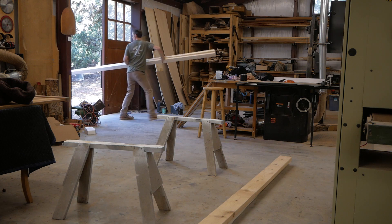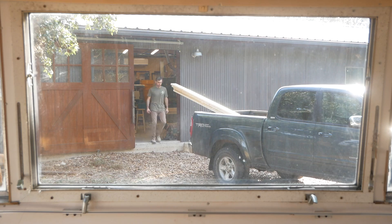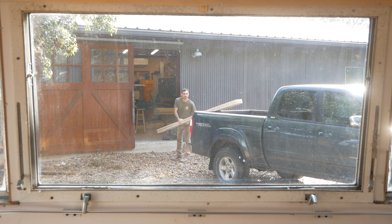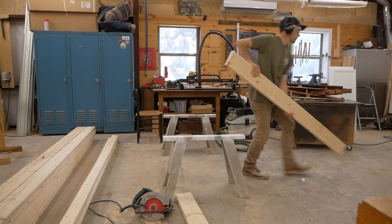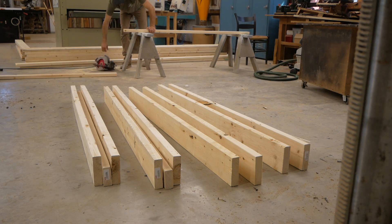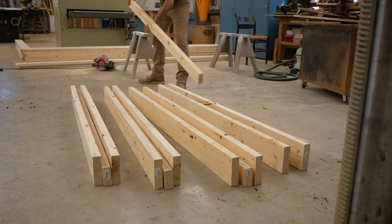This is going to be made entirely out of two-by-sixes. I'm not an engineer, so this is just designed based on some research I did. I'm pretty sure it's gonna hold the weight I need. I'm going to start the build with the foot of the crane. I have 12-foot two-by-sixes and I'm going to cut them in half to get two six-foot two-by-sixes. You can also see the two-by-fours I'm sandwiching in between — I'll cut those out as well and then just screw this together into one piece.